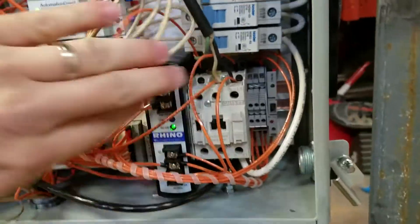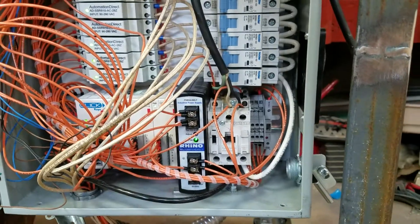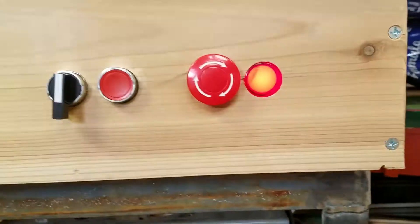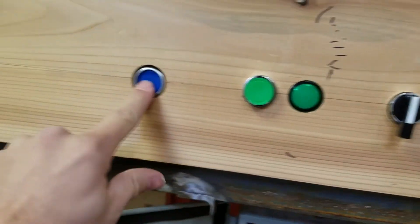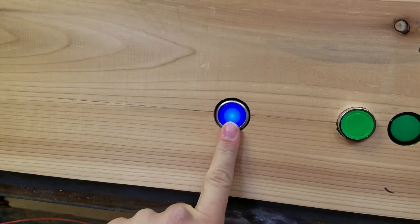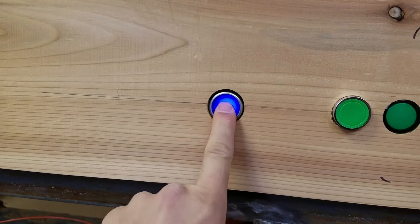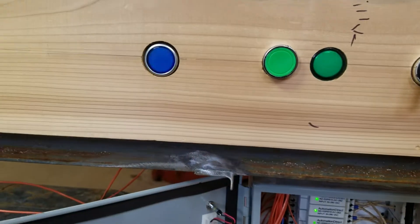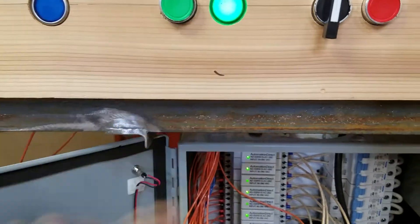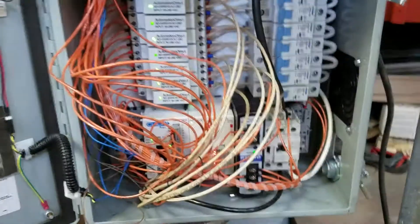You've got your contactor down there — if I hit the e-stop up here, that contactor drops out and the red e-stop light turns back on. Oh well, I just found a bug in the program. Got to fix that, because that's not supposed to do anything. But you pull that out and you're supposed to restart. Yeah, I've got to fix that. But that's why you proof things.